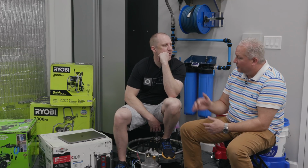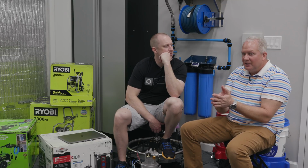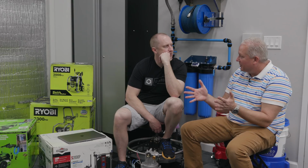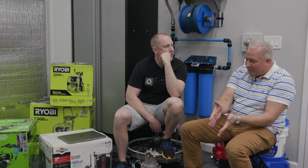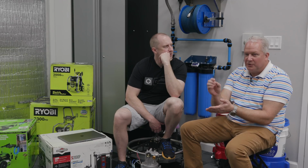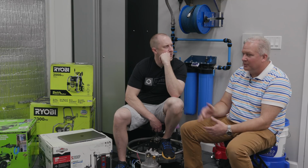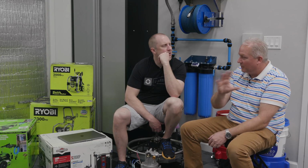Okay. So you showed that in some of your videos in the past. It didn't matter, a 15 degree nozzle versus a 40 degree. You're going to measure the same pressure and flow. Of course, your impact is a lot different, right? Because you have a much finer stream, like on a 0, right? So you're going to have a much greater impact force on a 0-15 than you would on the 40, which is typically what you're using doing car detailing and washing.